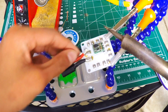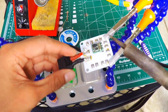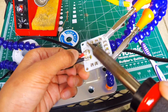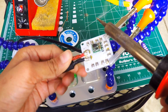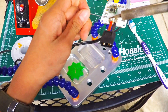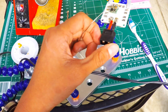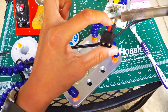Make sure it's all heated up, then do the same thing for the plus wire — heat it up just like so. Sometimes you actually need to put more solder on it, so apply a little bit more if it's not enough. Don't move it or else everything will move with it — just hold it like that.